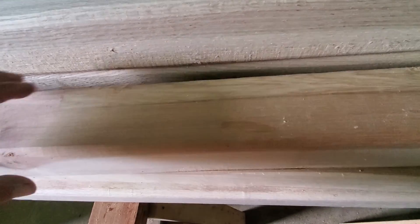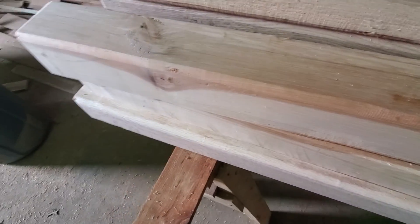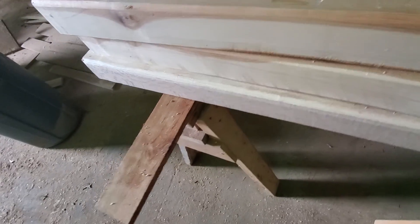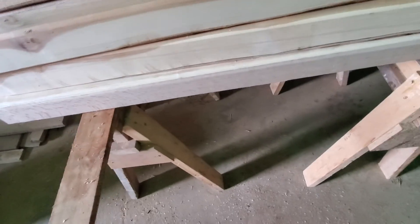So I'm going to go down five-eighths of an inch — why not, five-eighths of an inch would be good. I can go down five-eighths of an inch, just the width of one of these, and use the skill saw to do the heavy work, and then a chisel to clean it up, and that way these will fit right into one another. The top ones, of course, don't need to be notched like that, but that's my idea for these.